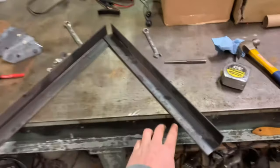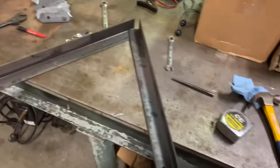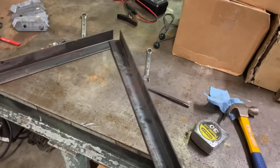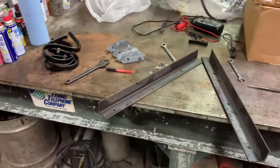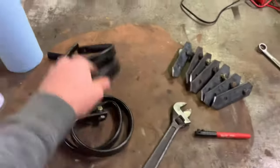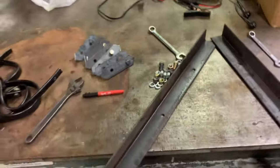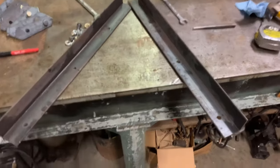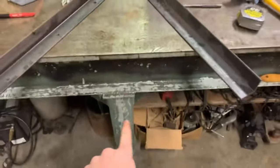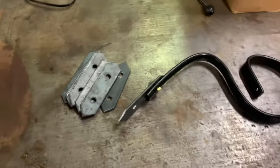So I just finished up my 2 tine bars, and I used the iron worker for that, punching some 1/2-inch holes here, and it's looking pretty good. Now I'm not sure about the angles, like if it's gonna be wider or narrower. We gotta look at that because the distance between each tine needs to be right if we're gonna do this. So got all the 7 teeth done right there, and now I'm working on where we're gonna put our 7th tine, if it's gonna be up here or maybe somewhere back here. So I believe we should be back at the farm in the next segment. Thanks for watching.